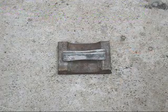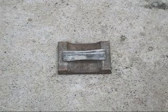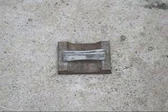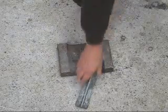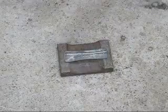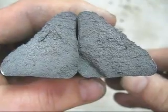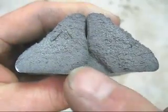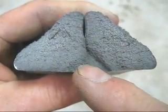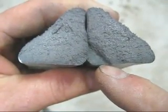I'm now going to break the leftover ingot and see exactly what sort of chill is in the iron. Here is the fracture from the ingot — it's perfectly grey all the way through, right through to the very edges where it normally will chill. It's completely grey all the way through.